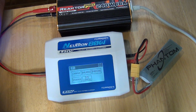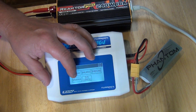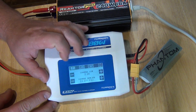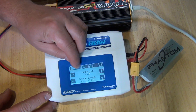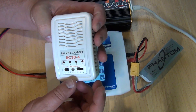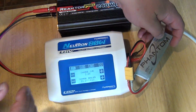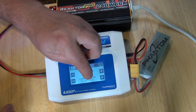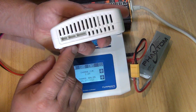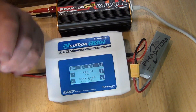So you click on LiPo and then you decide what you want: if you want to balance it, if you want to fast charge it, or if you want to put it in storage mode, or discharge. In my case we are going to try charging. Then you have to do the settings — how much current do you need? This is the function of the slider: one, two, or three. Here you can be more accurate: 2200. On the battery it says 2200, so 2.2A. We have a 3S battery — here we can see 1, 2, 3S. Here you don't have to change the settings; it automatically detects it when you plug in your balancing part.